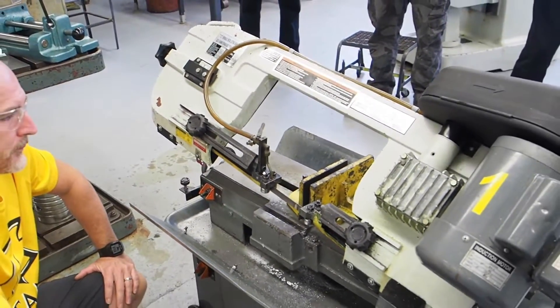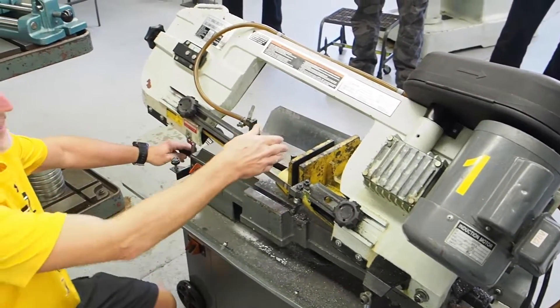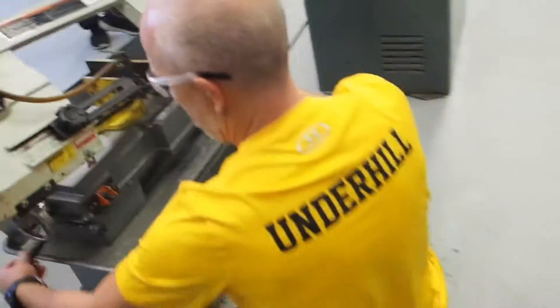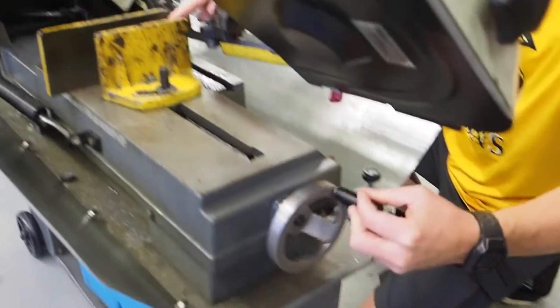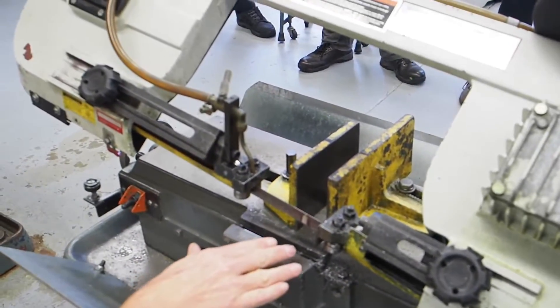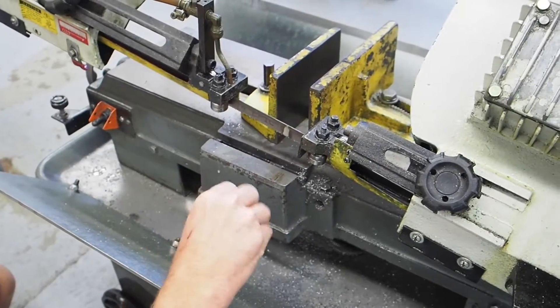What's rule number two? Be sure your workpiece is clamped securely. The vise opens and closes with this handle right here. You can see the vise opening and closing. We have to make sure that when we put our piece in the vise there's no chips in there, because if there's chips inside the vise it'll hinder the way that the vise clamps. So we have to make sure there's no chips in there, so we brush those chips out of there.